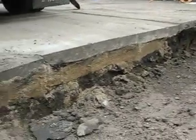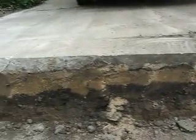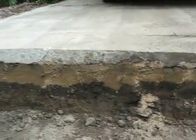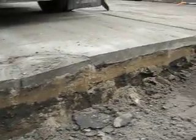When they put in this driveway, I bet it was a little bit low, so they just added a bit of sand to get it up to the right elevation. But it's only about a three-inch thick slab — there's absolutely no compacted base under that at all.